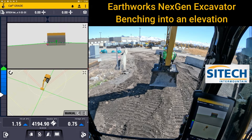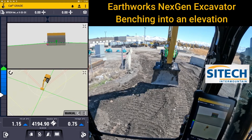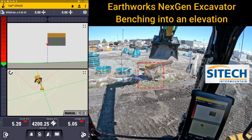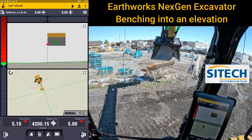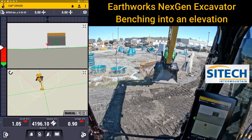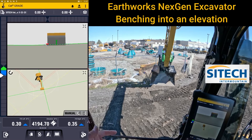There are a couple different ways to bench in. I personally don't like to use a survey control point like this one right here. This survey control point could get pushed into the ground or bumped. Your surveyors are actually using these for different survey work — they may set it up to put back sights on it for setting up total stations. If you do only have one of these, be very cautious, only set up to the side of it, and don't let your hydraulics settle down on it. You can bench over with a level or a laser, but this is not my favorite way because we don't want to mess those control points up.